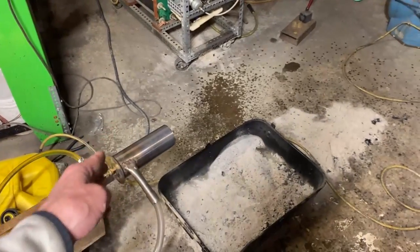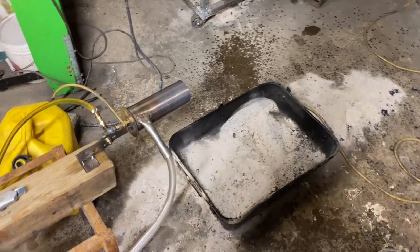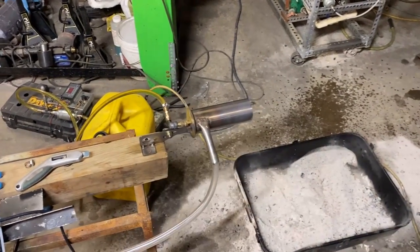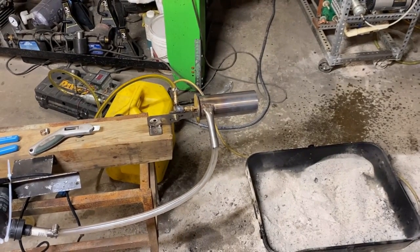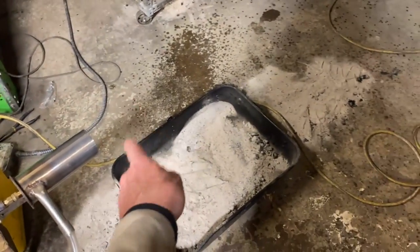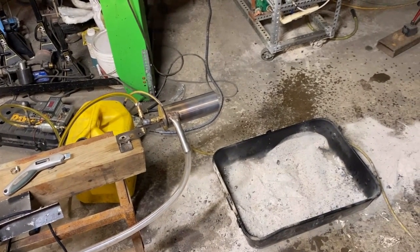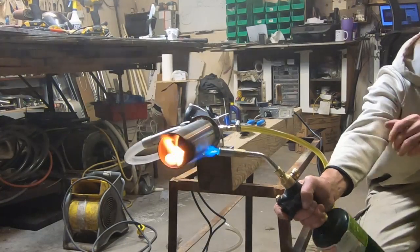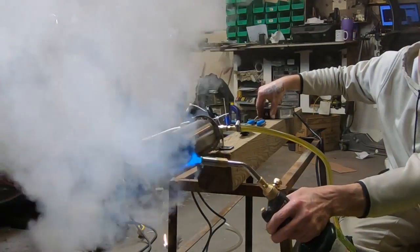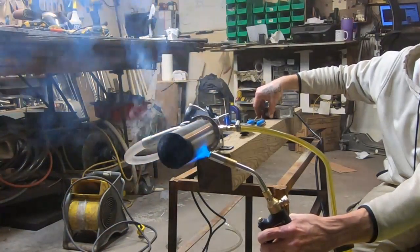I've cut the coil open after operation of just several hours and saw varnish buildup after just several hours — so out of the question I think. That nozzle, I don't like it. I hate that nozzle. We're probably going to rip that out of there, change it up, and make something a little bit cooler. We are going to go ahead and test it as is with the extension to gather as much data as possible regarding the optimum combustion chamber length. The rest of this is just some GoPro footage of me lighting this thing up for the first time and running it at various settings to see how it behaves and get an idea of what direction we need to go design-wise to make it work right.